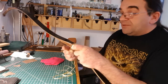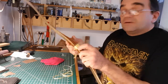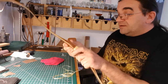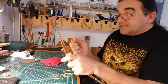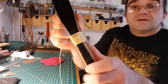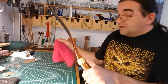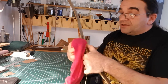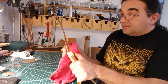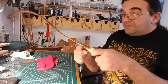If the joint pieces aren't touching, we do have an option for that as well, which we're going to explain in a second part. But we want to make sure that everything looks nice and representative — we don't want to make it way too thick, that's a major part. So far it looks very, very nice and we're very close. That's the beauty with fish glue or hide glue if you decide to use that — which I highly recommend — you can wipe it off. It's easier to wipe it off now than later.